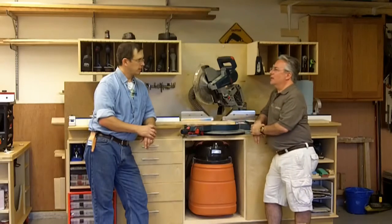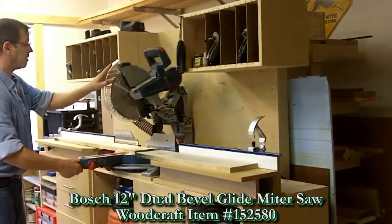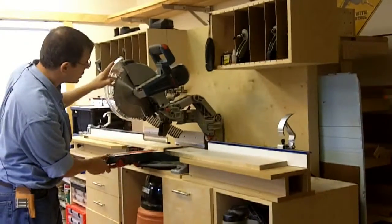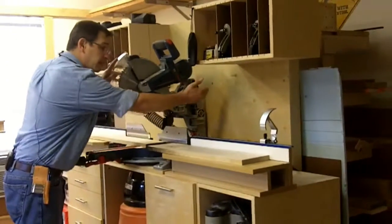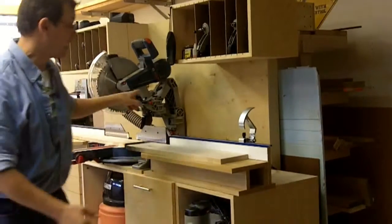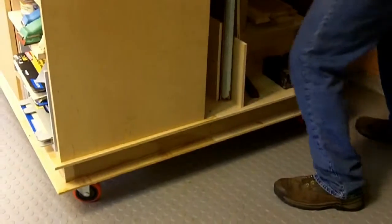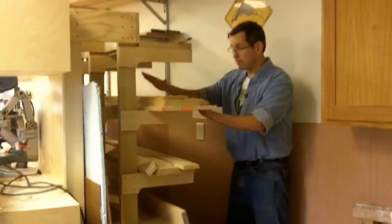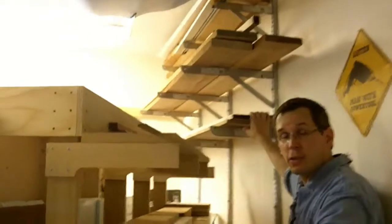You've got one more piece right behind this wall here — let's take a look at that for your wood storage. This Bosch sliding saw isn't cheap, but I found it as a very economical solution for a problem I had with lumber storage. The articulated arm doesn't slide back like a lot of sliding saws. Most saws have a rod which requires an extra 8 to 12 inches of clearance. By not having that rod, I was able to put storage on the back face of this cabinet. The entire unit is on six casters, and by rolling it out, you can see that I have a variable lumber yard's worth of stock. Between the lumber rack behind the cabinet and the additional lumber racks attached to the wall, I can store several hundred board feet.